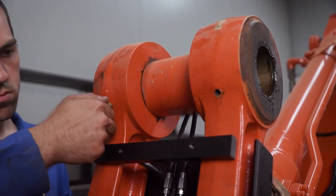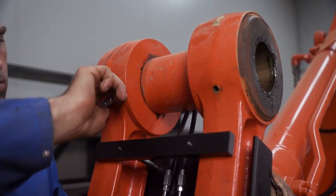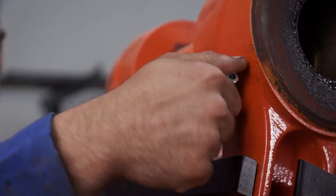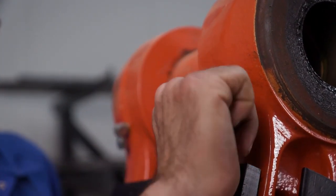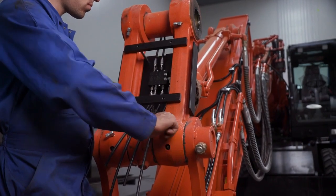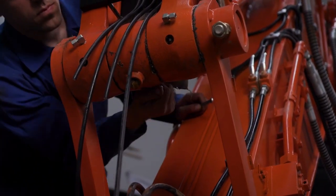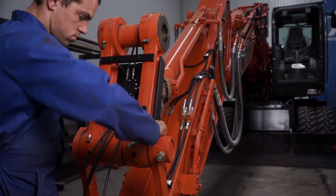As performed before, lubrication point fittings are installed into the newly located lubrication ports on the H-link. The installer rotates these fittings into their proper orientation to ensure the hoses are at the correct length. He torques the fittings to the recommended specifications.